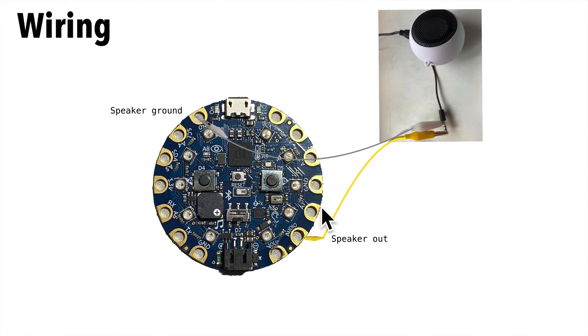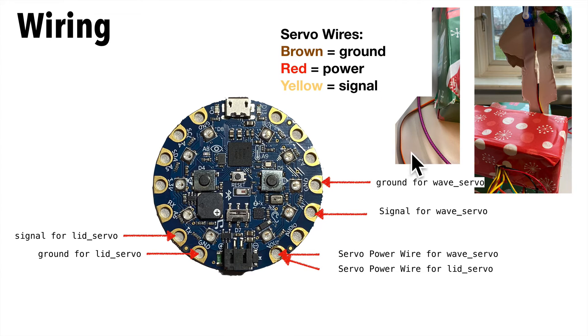The speaker has two wires going from it and its own separate power wires — this wire here is plugged into a USB. My speaker can also be wireless with an internal battery. The ground wire clips to the base of the RCA jack, and the very tip of the RCA jack clips to the audio out. Finally, there are the servo motors, and each servo has a triple wire: brown for ground, red for power, and yellow for signal. I've clipped both power wires into V out. The signal for the wave servo, referred to in the code as wave_servo, is passed through A1, and the TX pad controls the lid servo.